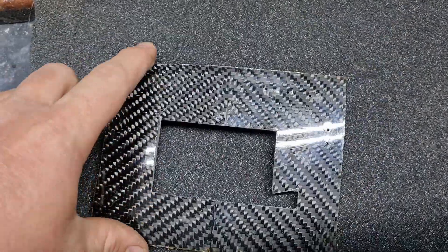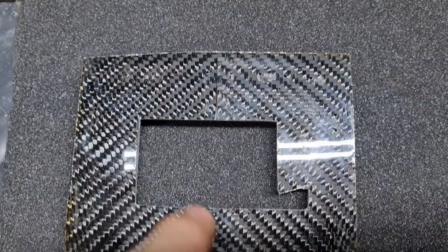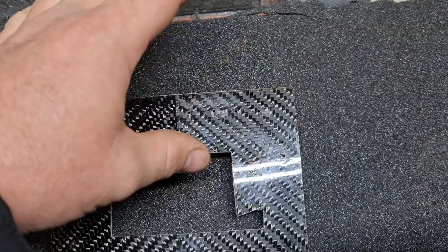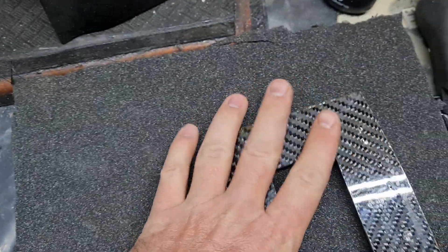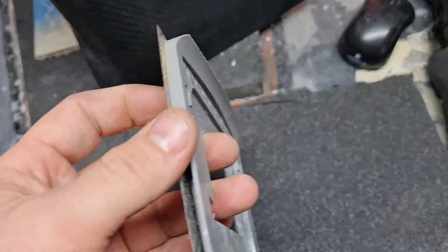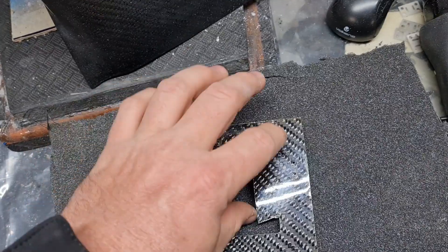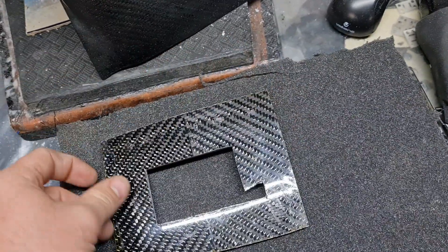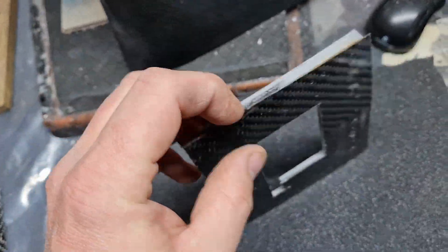What I did is I took carbon, cut it to get a V-join in the middle or center of the display as best I can, and instead of trying to skin it through all the angles I've decided I'm just going to skin the front of it. I put it on a piece of glass with some weight on the back, started trimming the edges, and I'm going to trim these edges out nicely — sand it down and spray paint the edges black and blend it in, so we've got the carbon face with a blue or black accenting.